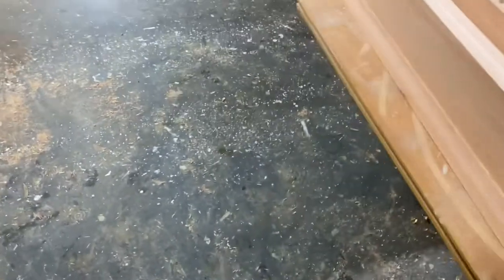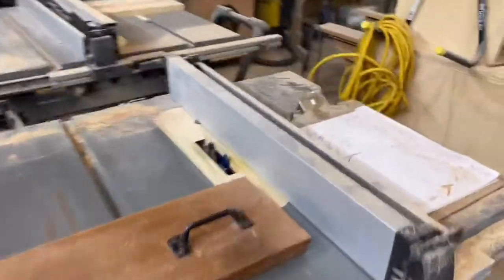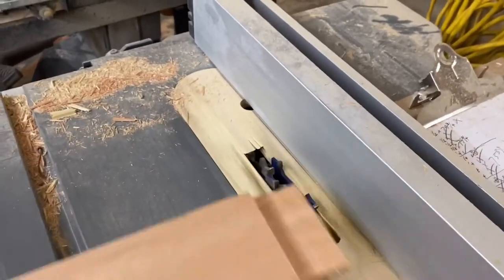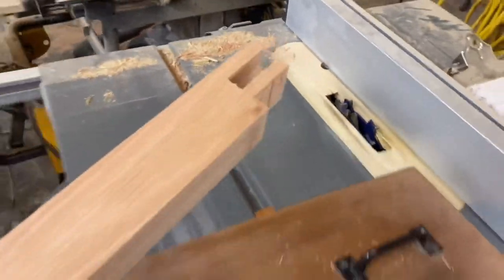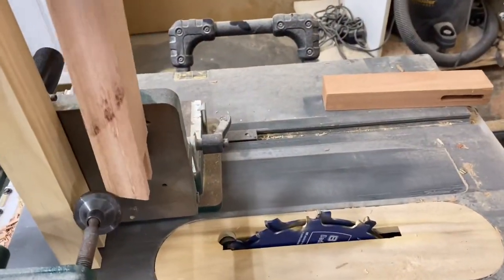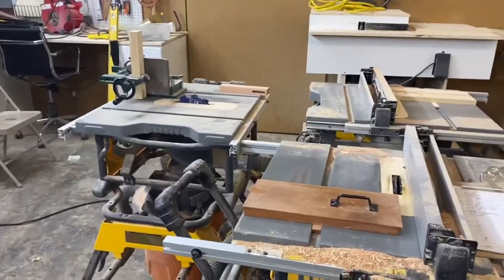To cut them at the same length, I take them over to my tenoning saw right here, put my piece on, and make my tenons. My meeting rail goes in the same length tenon, then I put my meeting rail in my tenoning jig and it goes over this piece. That's how I get that — one setup. I've got two saws here and that's all I need to make my sashes.